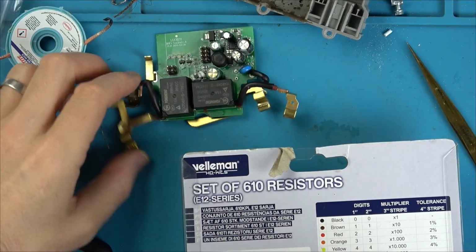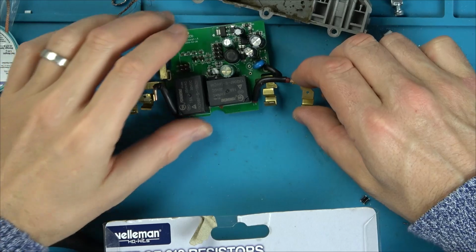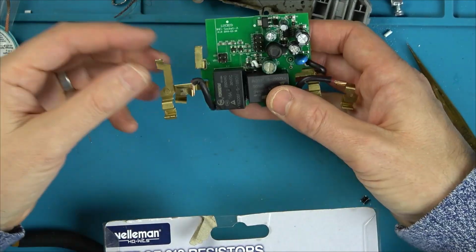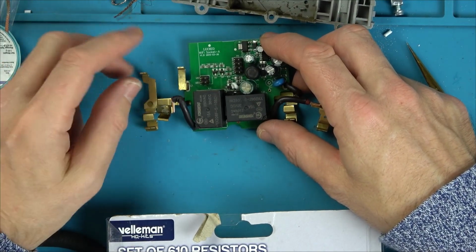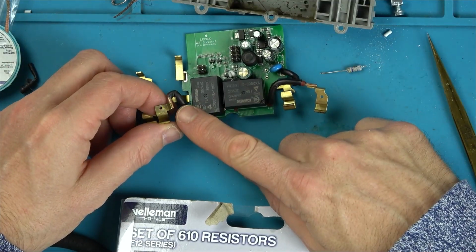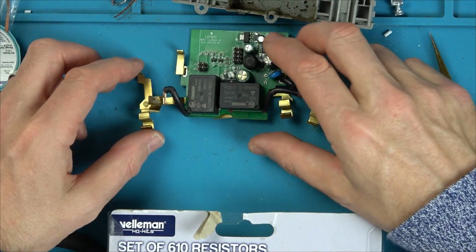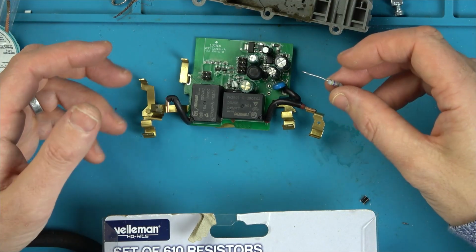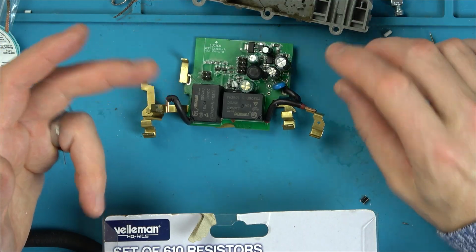Right, okay, I've just worked something out. Clearly there's 2 plug sockets, isn't there? So I was getting confused earlier. Look, basically the neutral comes in straight from the house wiring. We'll forget about earth a minute. This relay is for this live, this relay is for this live on this socket. They're 2 separate sockets. So I was thinking, how on earth do I know what to put in here, because it's a 32 amp socket? How big would that fuse be? But it's not doing that, is it?